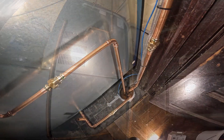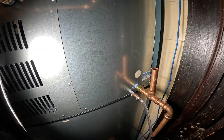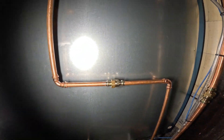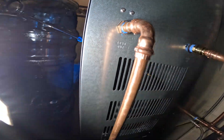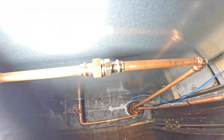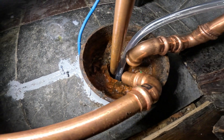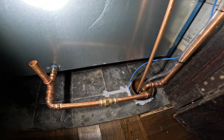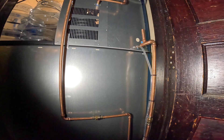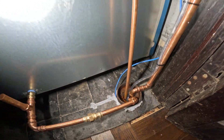This came out real nice. We turn the power on to the system and we're going to go through a fill cycle — it's going to fill up the water reservoir for 60 seconds, and whatever excess comes through here. So we're going to watch this union and make sure there's no leak. When the compressor starts and builds up pressure, we're going to be dumping water out of our water source condenser to cool it down. We're going to make sure there's no leaks. This thing has been dripping — a little condensation from the ice bed, ice melting inside. So it looks like that one's already good.